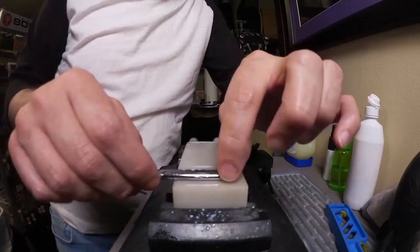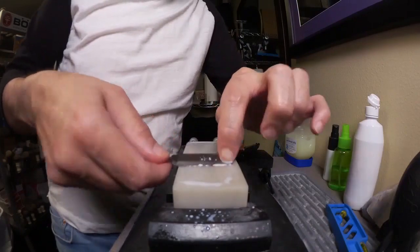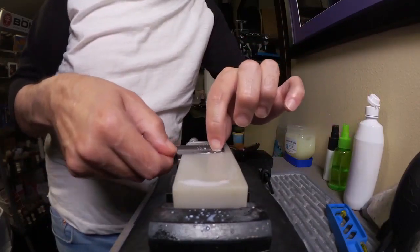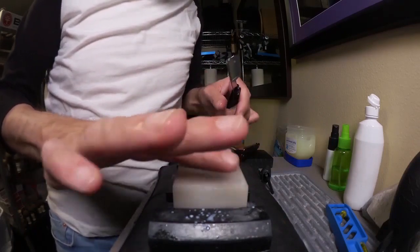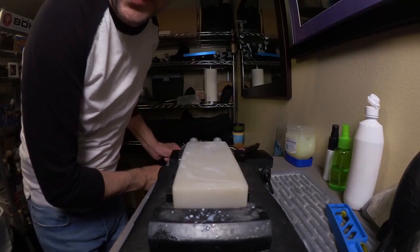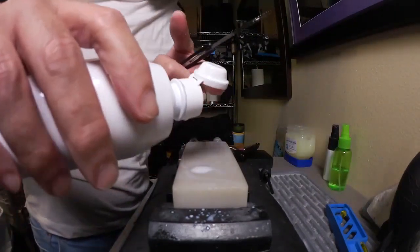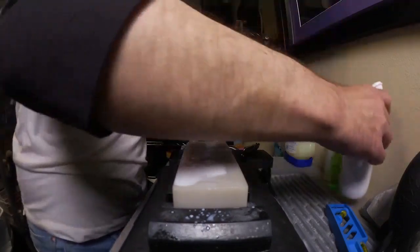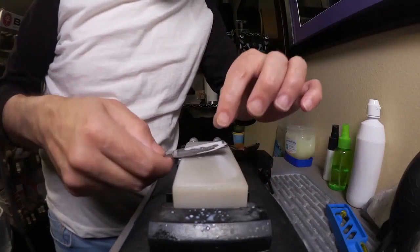You can probably tell that I am touching the toe area mostly at this moment. And I just want to get to the point where, when I wipe off the Vaseline and take a look, I see fresh scratches starting from the rear of the bevel and permeating their way toward the toe. Sorry, not the toe, the apex of the razor, right?